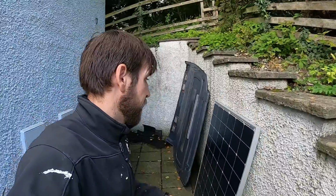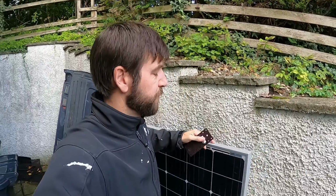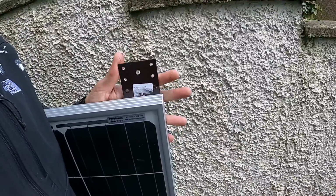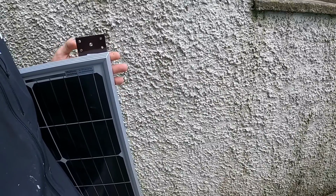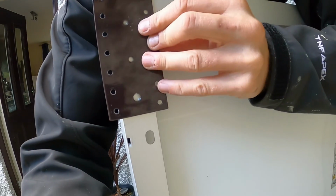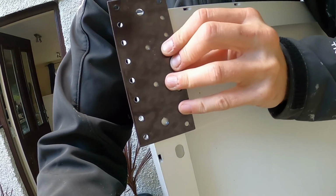So the idea is, I'm going to screw this into the Unistrut, connected by the channel nuts, which will sit in place on the Unistrut, and then I'm going to guide this into place where it needs to be. So this bit will obviously be stable. I'll line these bars up with the Unistrut, and then wherever I need to mark it, I will mark it underneath. Now, one of them I've put a hole in the center here, and it will go through that, which is a single piece of metal.